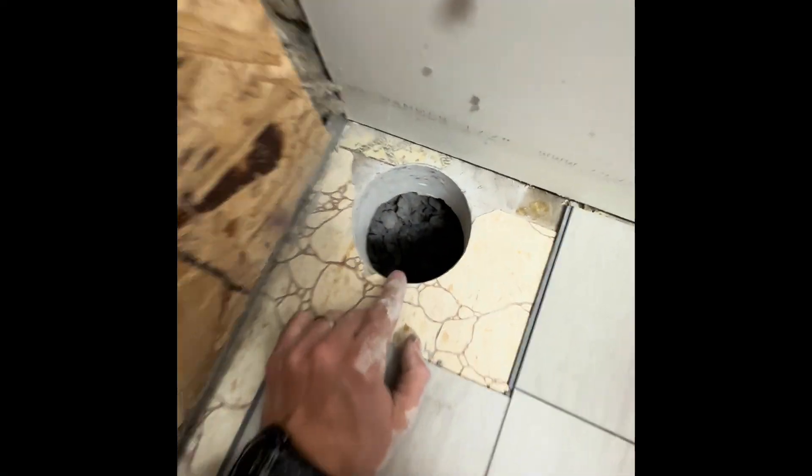The science behind radon as I understand it: it builds up and collects under the earth and gets released through your front lawn, the mountains, the Rockies, and your house included. In the house it gets contained, so you're trying to exhaust below the slab. The way a slab works is you pour gravel and then pour concrete on top — there are enough gaps in the gravel that radon draws through, and you exhaust it out through this pipe.